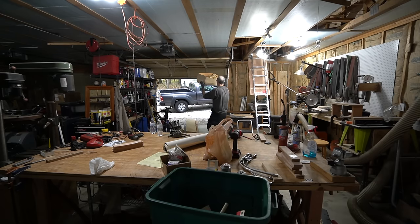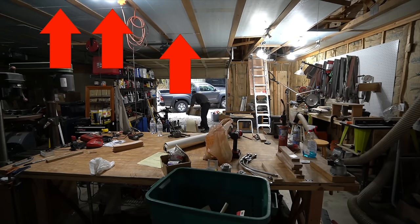Nothing was cut correctly and there were a lot of air gaps throughout. In the ceiling the rigid foam insulation had the same issues — air gaps everywhere — and a lot of that heated air would just rise up into the attic space and dissipate. It really didn't do a good job whatsoever. I actually worked in this garage for a couple of years with that poor insulation and the difference between poorly insulated and well insulated is staggering.